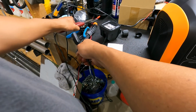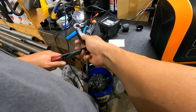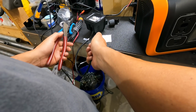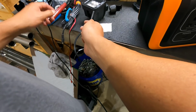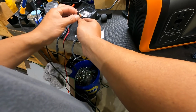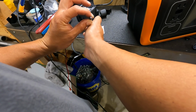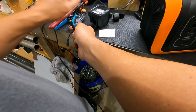I just got it tucked in my arm over here, but always when I get these lights, I just cut them, get rid of these, because they're too big, you can't run them through a cage, and they get in the way. They're really ugly. You don't want this big bulky thing sticking there, so we wanna hide this, make it clean. The only thing that's in here, guys, is just 2 wires, positive, negative. So we're gonna cut these, hook them up, and I will show you the pattern on this.